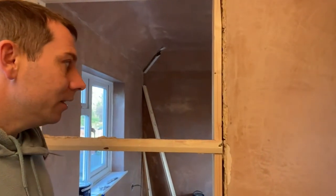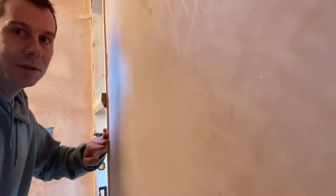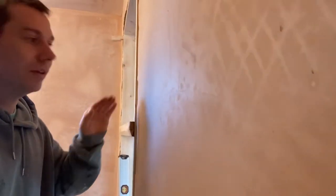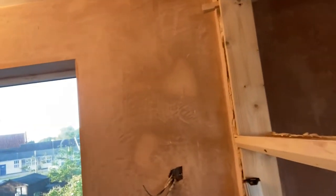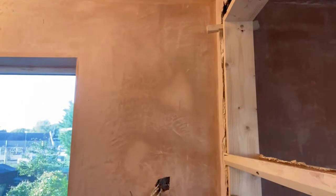Once you have that in, you also have to play around so it's as flush as possible — you see that. The wall is wonky so it's better to have it a couple of millimeters off, so your architrave sticks out instead of being bent and pushed by the wall. That's how you set it up first.